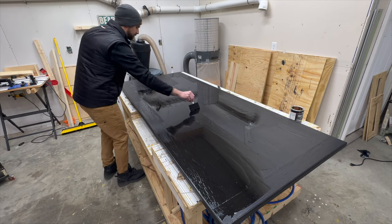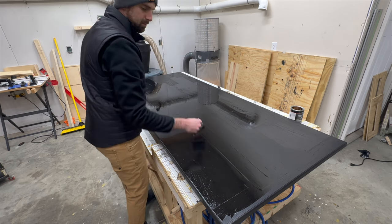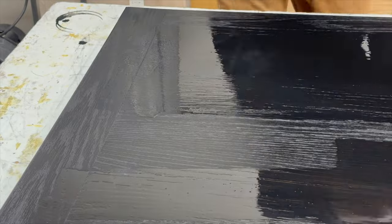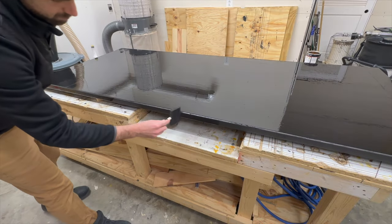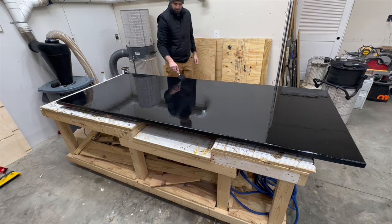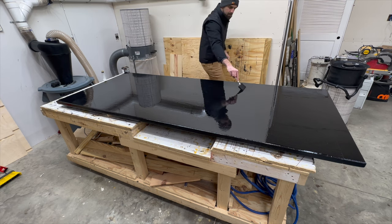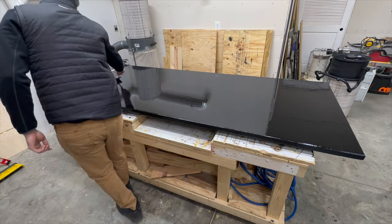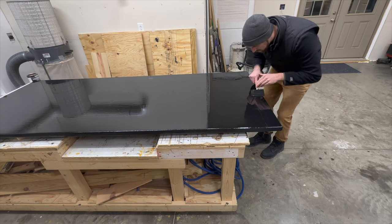I'm using a foam brush to brush this on. After you get the polyurethane put on the tabletop, the first thing you want to do is just spread it all over. Try to go with the grain, but really at this point we're just making sure we have adequate coverage across the entire tabletop. The process and order of surfaces is similar to how we put the stain on — top and breadboards, then the sides. After complete coverage, start on one end and pull that polyurethane all the way across the full length overflowing into the breadboard, then go back over the breadboards separately going with their grain.